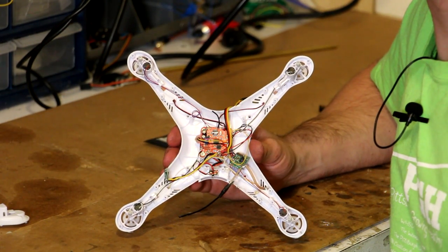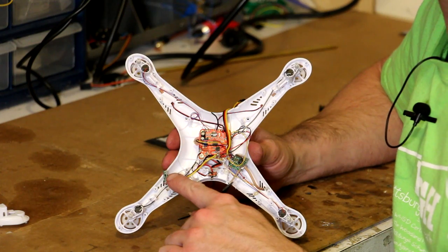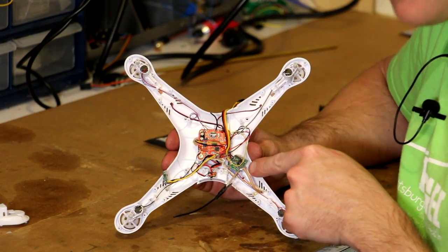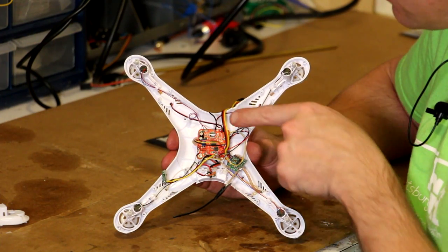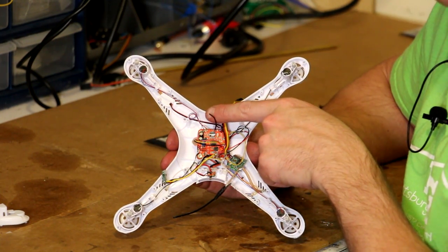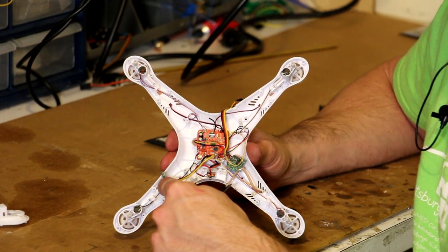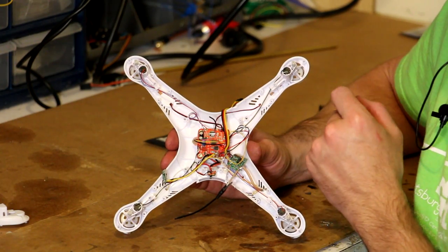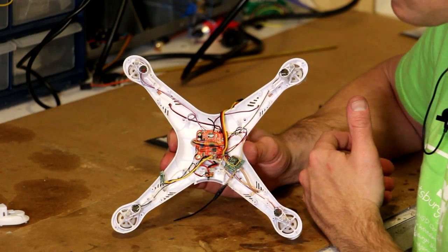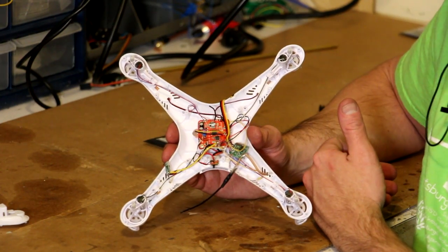Inside the vehicle the wiring will look something like this. Over here I put my voltage regulator, and over here I put my video transmitter. That's because the receiver antenna is here on the vehicle — I want my transmitter and my noisy voltage regulator as far away from my receiver as possible. Remember, just a few millimeters can be all the difference in flying to the next room and around the house versus only being able to get a few feet.